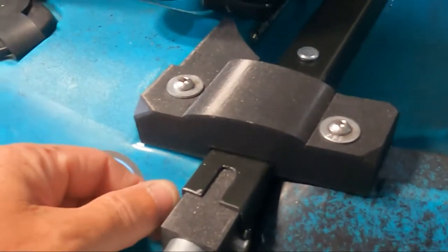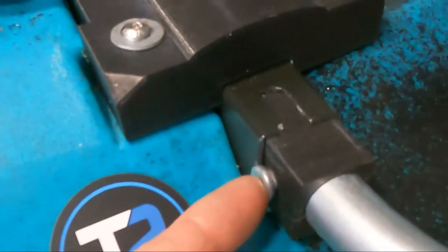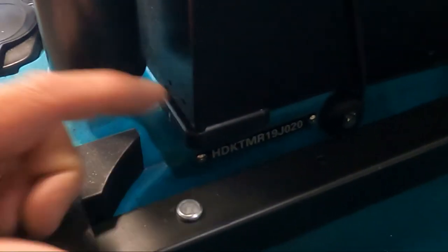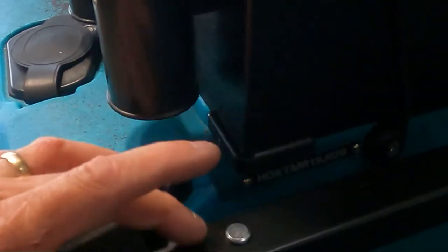This here is also a 3D-printed part with an inch-and-a-half clevis pin held together with a couple of zip ties on the pin in the front. If you come across, you've got a clevis pin at the top as well. This additional clevis pin I put in is just to hold it in the up position — you don't have to have that there. The hole you can see here is the actual hole where you put the clevis pin when the gear is in the down position.